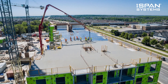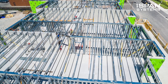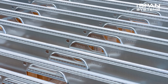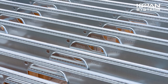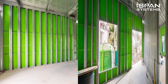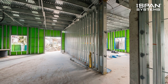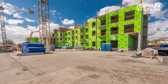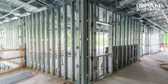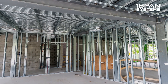The main problems I was trying to solve were fire, vibration, and acoustics. The fire test should be one hour in order to be able to use it in buildings six stories and less. All of these floor systems were tested and they were all getting to maybe 47 to 53 or 54 minutes in duration. My mission was: how do I get six, seven, or eight more minutes out of this fire test? Our fire test passed by two or three seconds — just over 60 minutes.